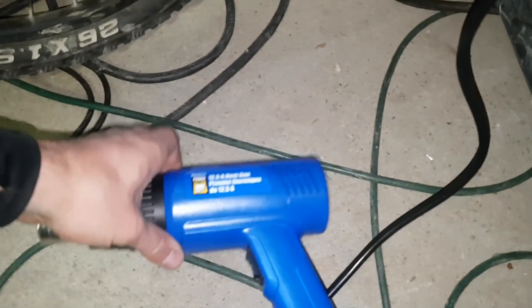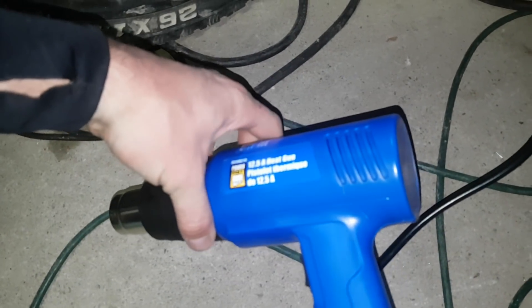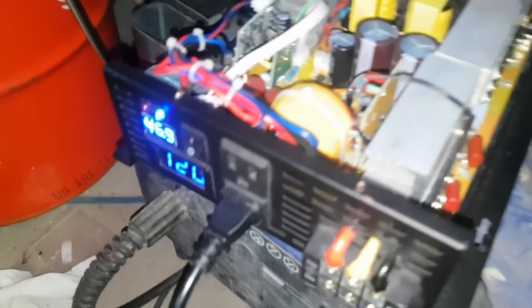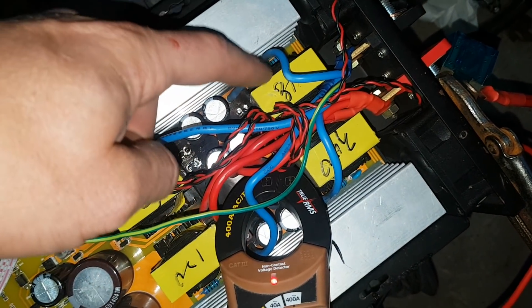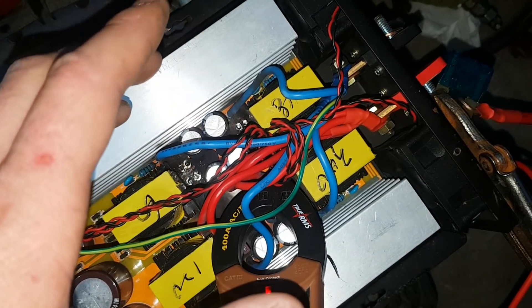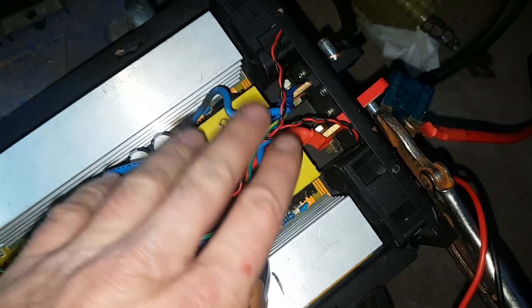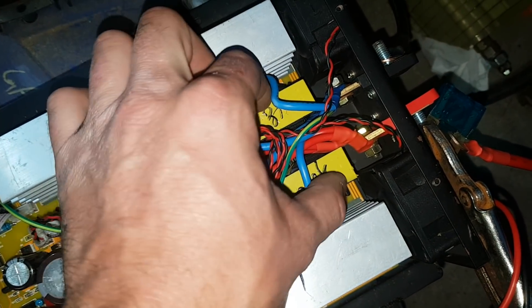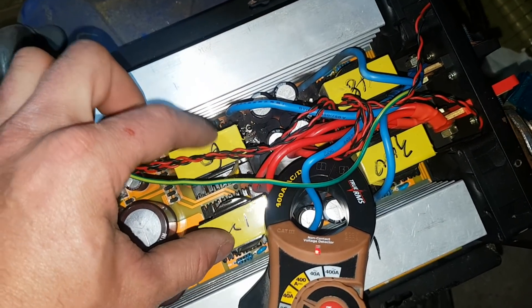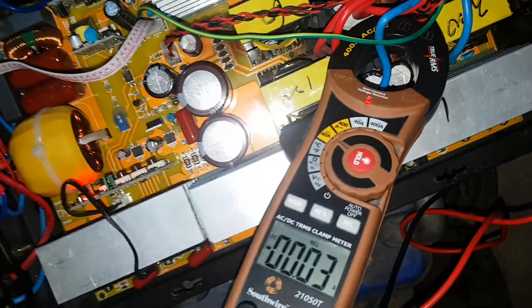So what we got here is a 12.5 amp heat gun. I was just testing something — I was very curious. These are the wires coming directly off the negative posts. These wires are shorter, these wires are longer. And I posted a video saying that the problem with this design — the only problem I can see — is these get the most load. These get much less load because the wire is almost twice as long. I'll show you exactly what I mean by that.